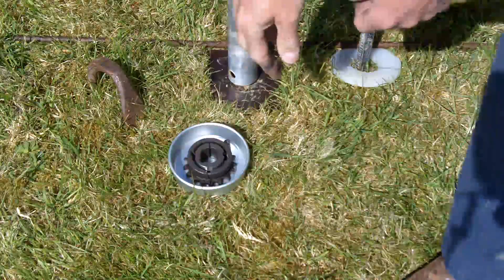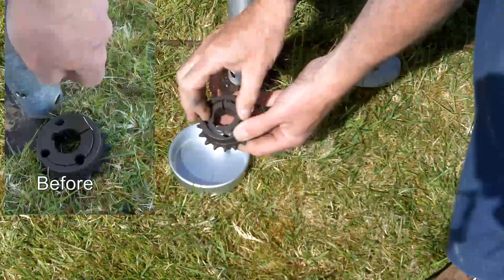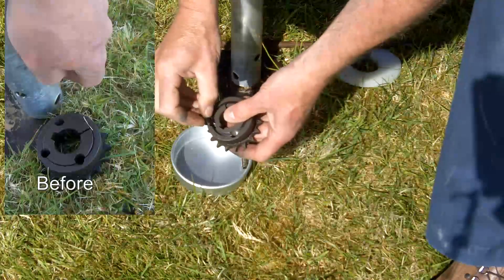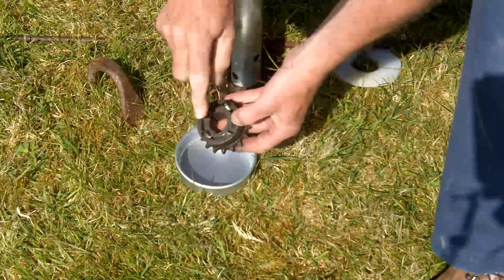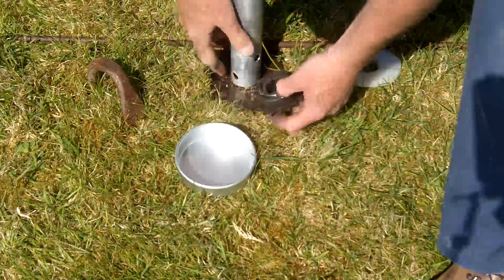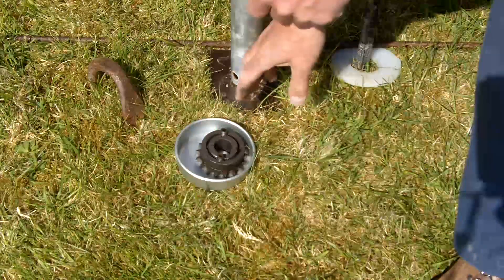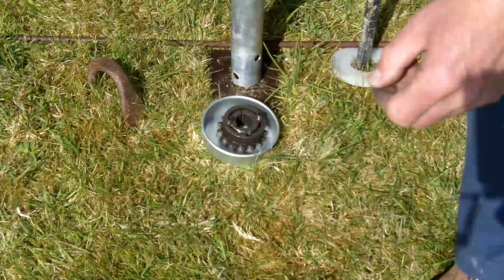Back at the foot of the mast. That's my turned-down collet, and that'll go there like that. When these two little grub screws — Allen screws — are in, they pull the collet tight onto the 25 millimeter motor shaft. But they'll be sticking up, so what I'll do is cut two mouse holes in the bottom of the pole, and that'll form the bayonet fit that stops it twisting. Anyway, I think that's as far as I'm going on this video. I hope that hasn't been too boring for you. Thanks for watching guys. Bye-bye.